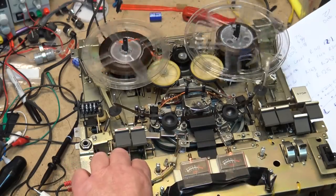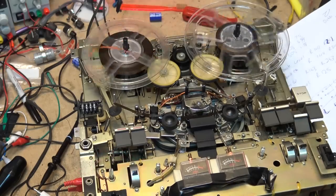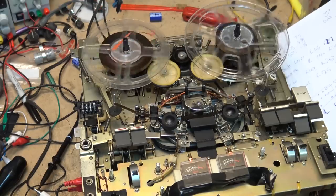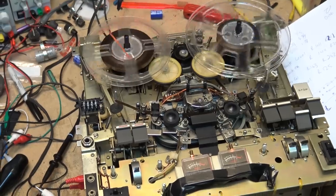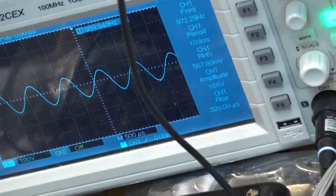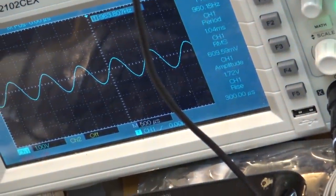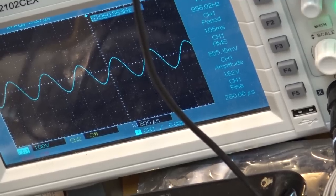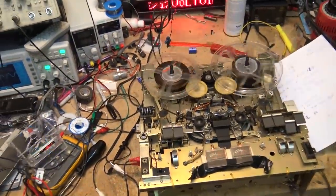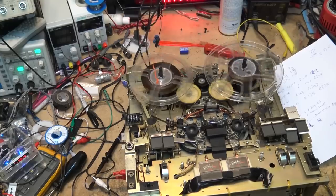If I drop to the special tape it's going to drop almost 3 dB. The output signal is supposed to drop down to about 600 millivolts. If we look over here on the scope, we're actually about 590 — so we're in the ballpark. This is not a special tape, it's a regular tape, so normally you would have it in normal mode.